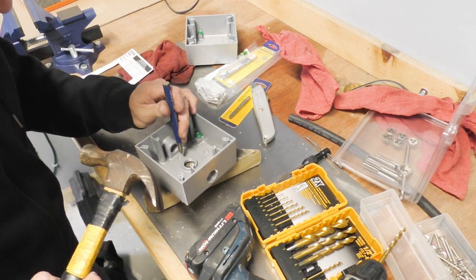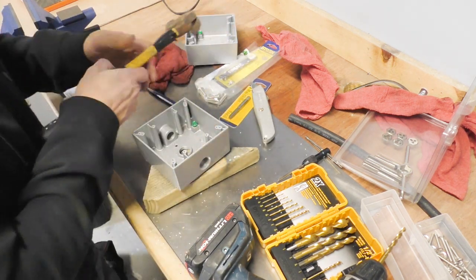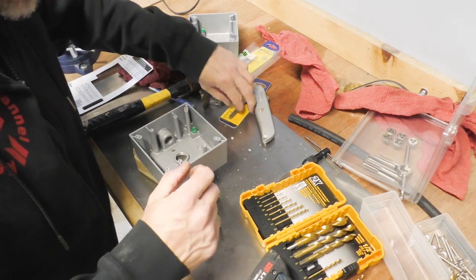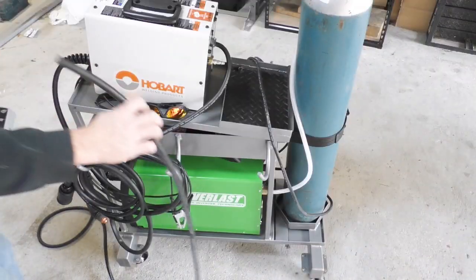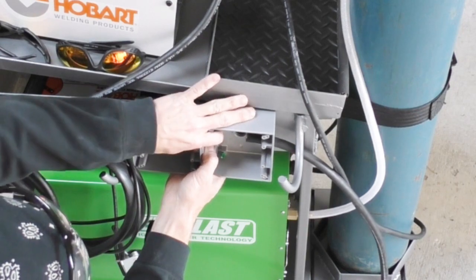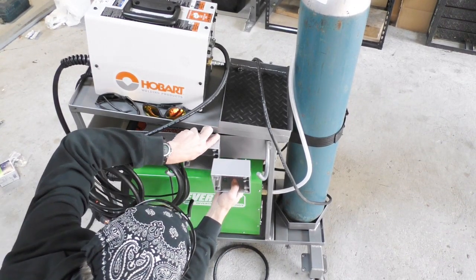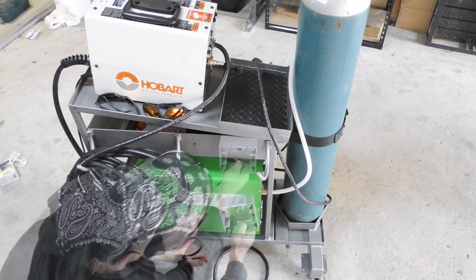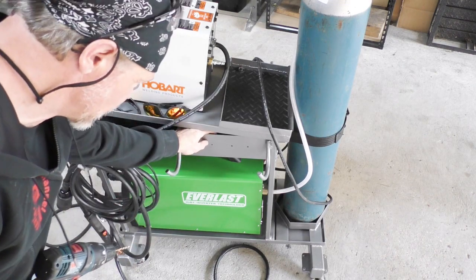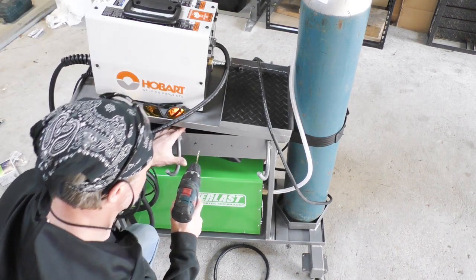That whole knockout knocked out on its own — whether they're meant to or not, they did. Now I can just open the hole up. The next order of business is to mark exactly where I want these. Slight change of plans — I'm not gonna try to drill and tap this because I don't think I quite have enough meat here to catch a good thread. After looking at it again I really don't. So I'm just gonna put a bolt straight through.